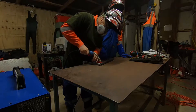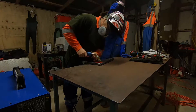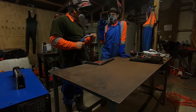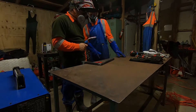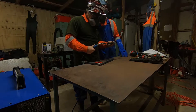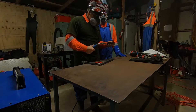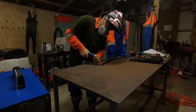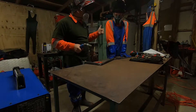45 degrees — that's 90, 45. You're scaling here and you're welding across there. How much wire do you have to have out? Three centimetres. So how much is that out? I'll probably go about 20, which is five seconds. You need this hand as a guiding hand, and then follow that groove. Let's go.